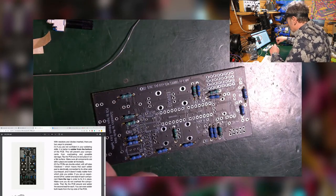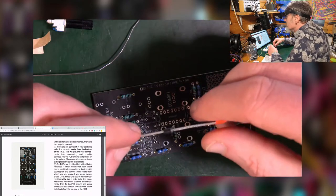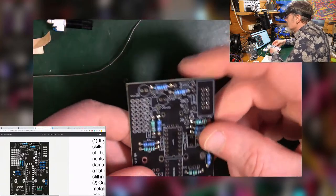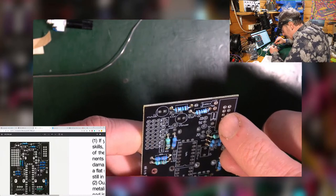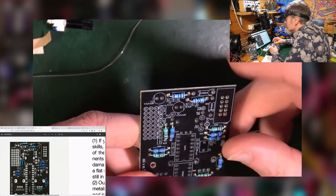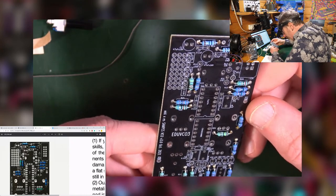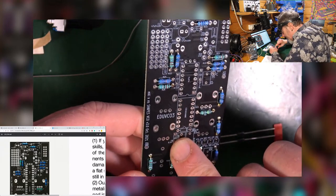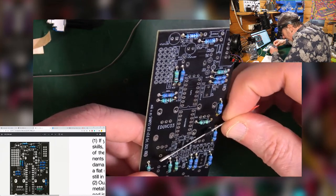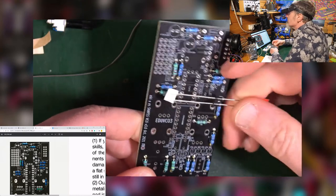I've got big thick ones here, and I've got a little one here, which was input from before. So my understanding is I've got two at the top here, VD1 and VD2. And where's the other one going to be? Down here, VD3. Do these have anything written on them? Just about, but I can't read it. 5819. Yeah, 5819 is printed on the board. Good.